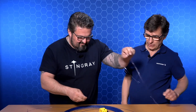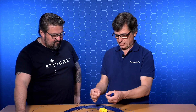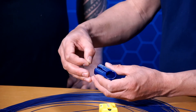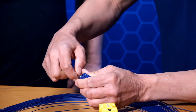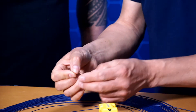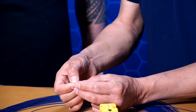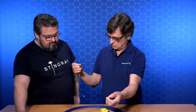There is actually an alternative way to reach into the fibers if you don't want to use the Miller tool. You can crush this outer acrylate with the stripping tool we used earlier, but place it this way instead and just push. You can hear it — it crushes the outer sheath and scrapes off the acrylate, and then we have the fibers free. Then we can just take the black one and pull. That's how it's supposed to be done.